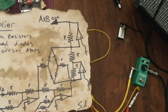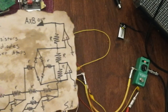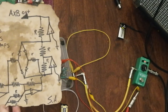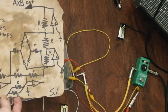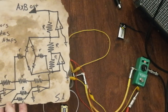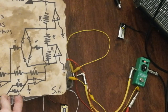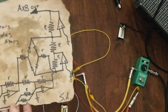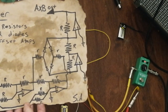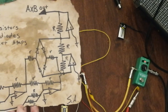Although in convolution, the next step is actually to sum the resulting multiplications together. So you might notice that these 2 op amps over here can actually be made common to all 16 multipliers. Also, this input works in common and differential modes. You don't really need to work in that basis set. You could work in 2 different combination basis sets that also work out. And you can work through the implications of that for the rest of the circuit, which is a headache, admittedly. But you get down to just 1 op amp for this mode converter.